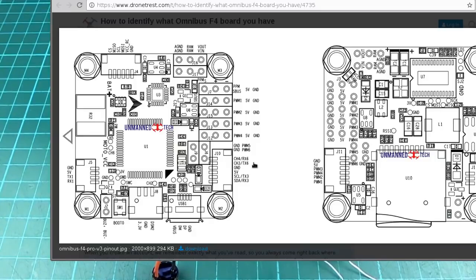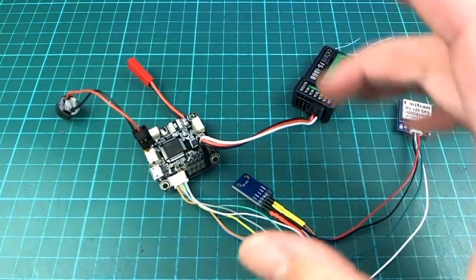But yeah, you can use this diagram to check which wires coming out of each one of these plugs are going to be the one that you want to connect up to your compass or your GPS or your telemetry or whatever. And yeah, the SH83 guy, by the way, put in quite a bit of work to getting this board mapped out to figure out which is going to be which pins and to get it all up and running. And I think he's tried to stay true to these connections as much as he can, which is quite nice because that means that this diagram is applicable to our new Arduplane firmware as well. But as I said before, just keep in mind that the SD card and the OSD overlay will not be working at the moment. So that's about all I have to show you for now.